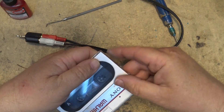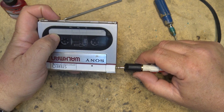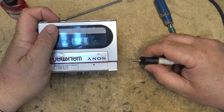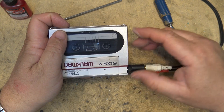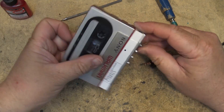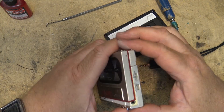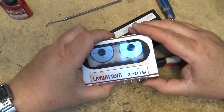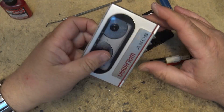If there's no tip — if you don't plug headphones or something in here — it won't start. That's so that if the button gets pressed in your pocket you're not going to run your batteries out. How ingenious is that? When you take the tape out and close this down, it covers the headphone jack so there can't be any headphones in. So if you're carrying this in your pocket and a button gets accidentally pressed, it's not going to run the battery down.